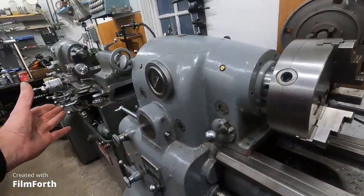But watching myself the last time I cut threads — I'm out of practice cutting threads. I'm not cutting threads on hydraulic cylinder rod every single day. And you get a bit out of practice. So that electric lead screw reverse feature is kind of handy for me now because I kind of slow it down.